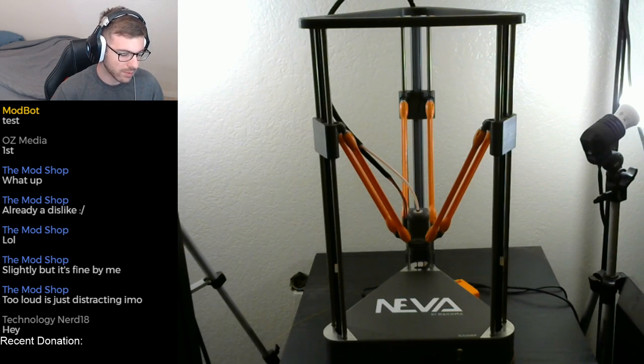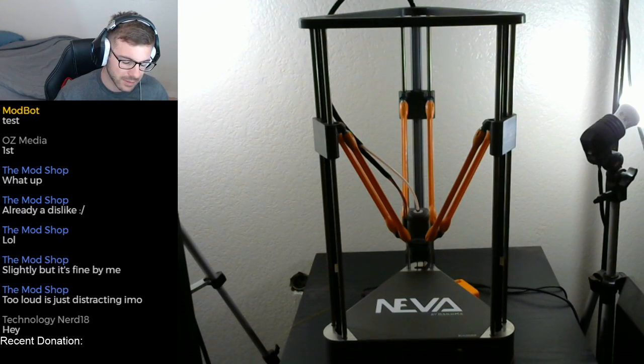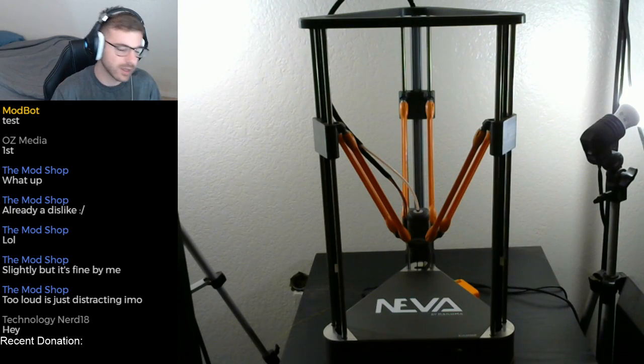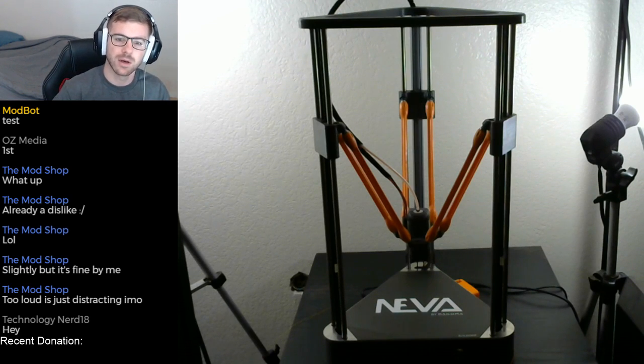So also, I think once I'm just using their little simple interface, Cura that they've, I'll show you guys here right now, actually. But it doesn't have any options for retraction or anything like that. So I think once I do a little bit of tweaking on the retraction settings, it'll get rid of the stringing. But hopefully, you guys can see that.